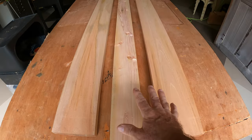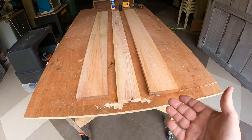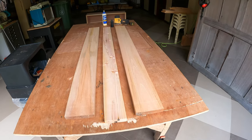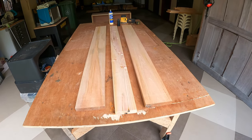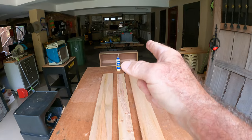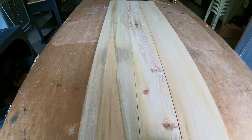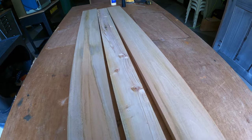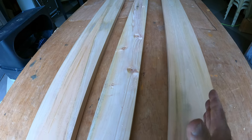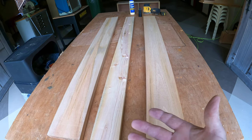There you have it — we cleaned up these one-inch thick boards for the seat and they came out quite well. I used the joiner first because they were warped on the side, then ran them through the planer to make everything one inch thick. That's a quarter inch thicker than the mahogany facing we used for the cabinet itself. Dowels will work fine for alignment, but the glue is actually the strongest part — as long as we have a good glue surface on each board and clamp them together well.